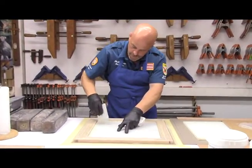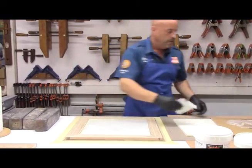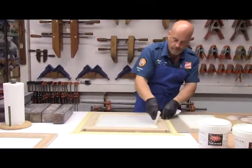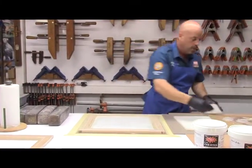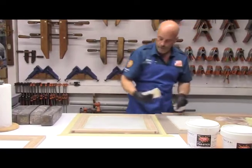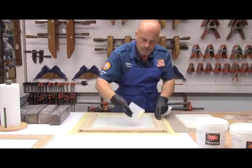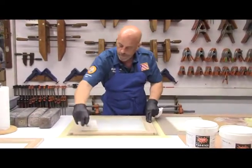So what I did was take two pieces, a quarter and a 3/8, and I milled the face off the 3/8. And that brought it down just under 0.06 of an inch through this thickness sander. It gives me exactly what I need to put in there.